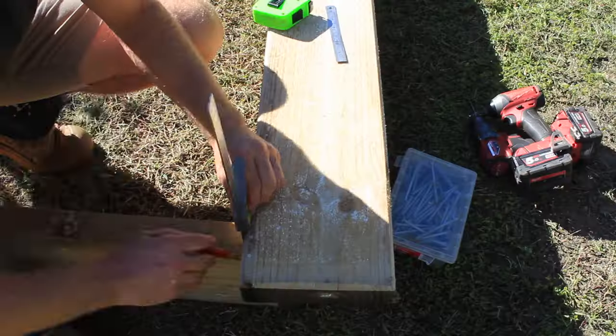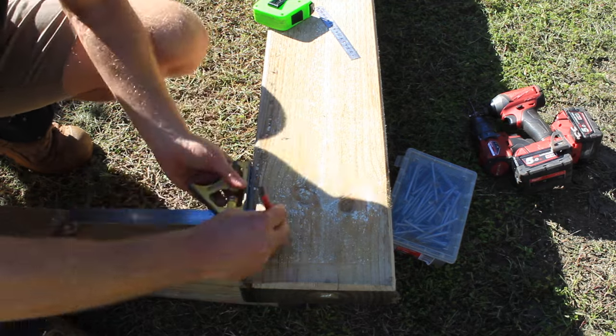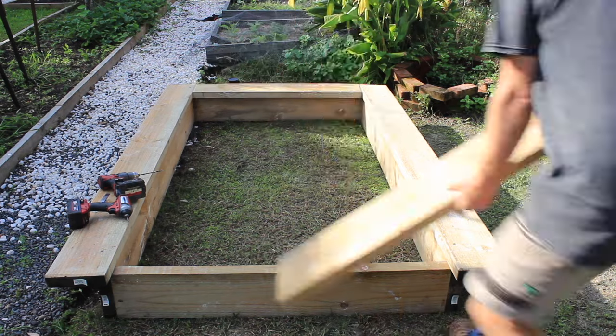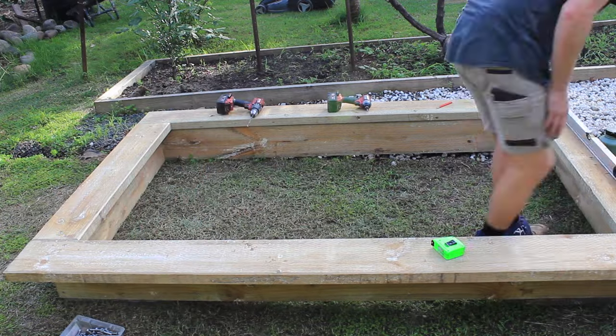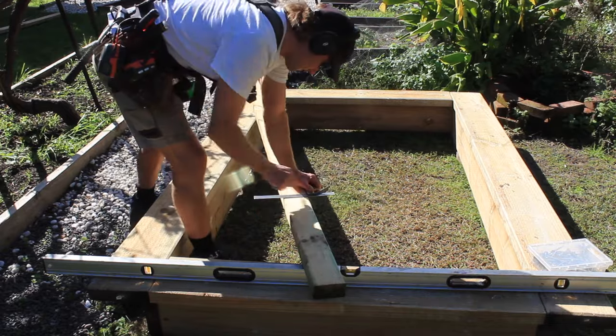Next, all I have to do is carry the timber into place and screw it into position. I'm using a few bugle-headed screws to attach the bench seat. Once all the seating timbers are screwed into place I'll adjust the sandbox to be level. To finish the framing I just need to cut three blocks for each side to add some extra support for the seating.